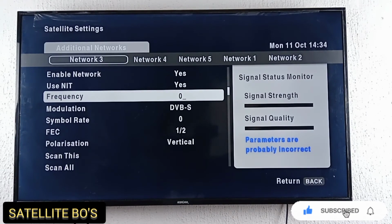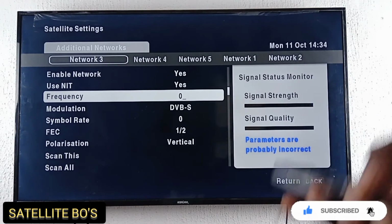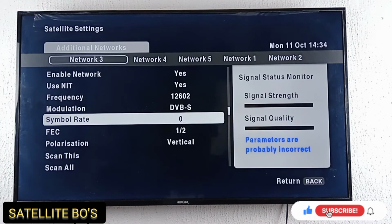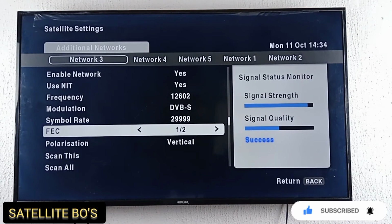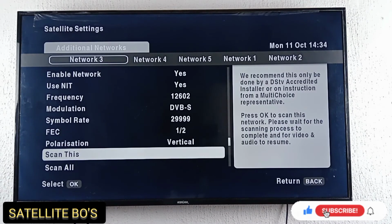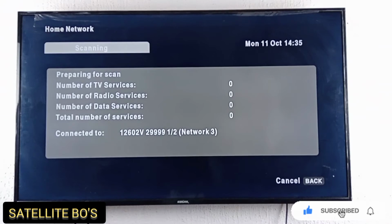Then go to frequency. What's the frequency? 12605. Symbol rate. What was the symbol rate? 29999. All right, go to polarization, it is V. You see the signal strength, signal quality here. So just go to scan this, press OK. There's nothing hard there.